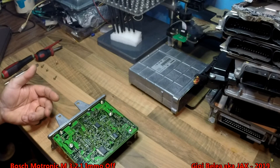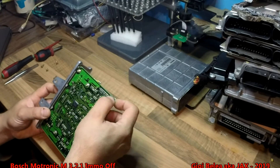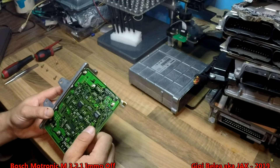So that's how you do it. Now that we have the EEPROM done, we are going to solder it back. I already marked its position on the board. When you solder it, put a little bit of flux and then solder it back.